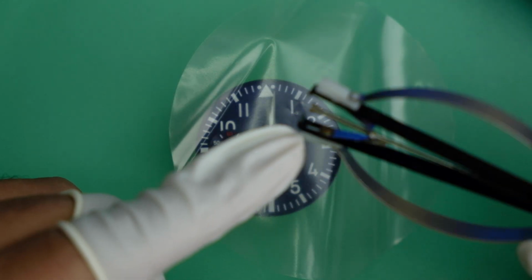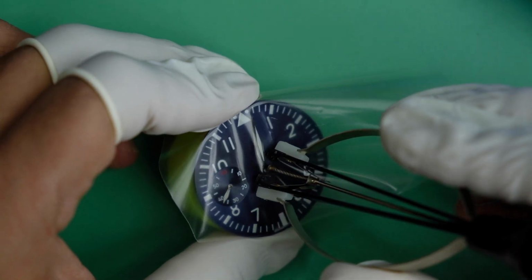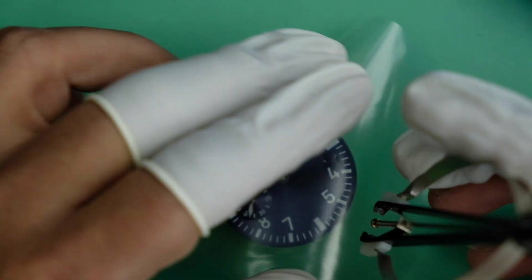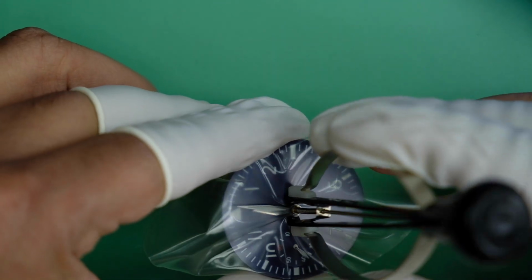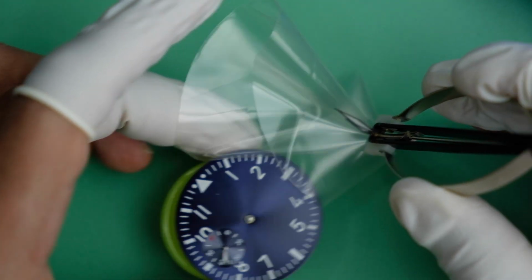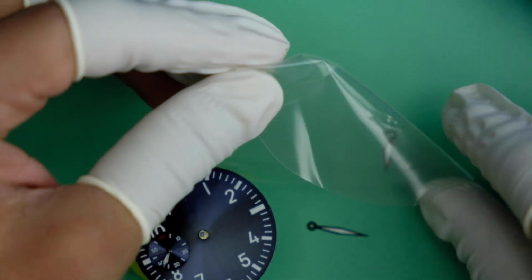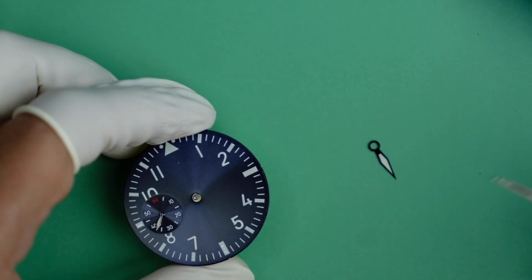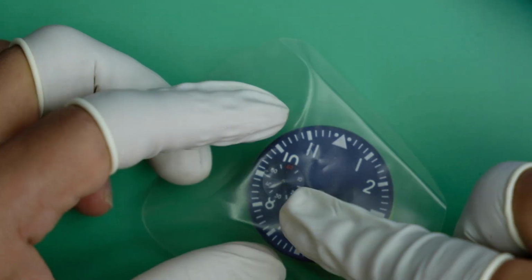Take the Cannon pinion and hand remover. This one, you just hold on the edge sides, and then you press onto the dial and then press the sides inwards. You'll see now, and that's it. It automatically pulls out the hands. For this watch, we have also the small seconds, so that has to be taken out separately. We put these hands in the container.